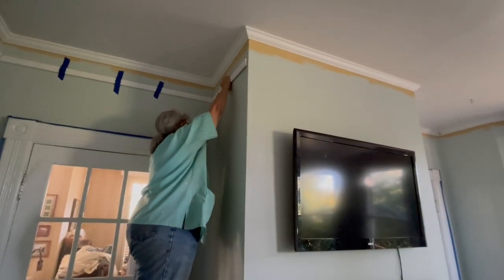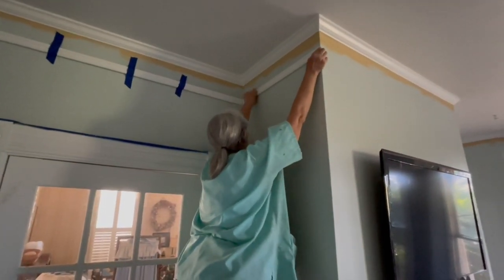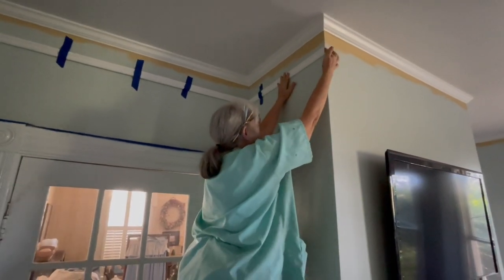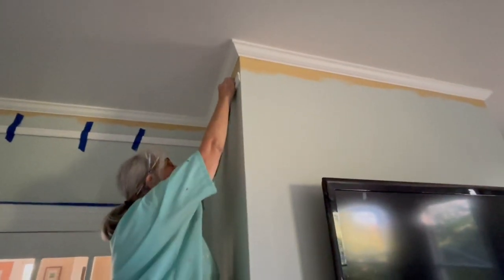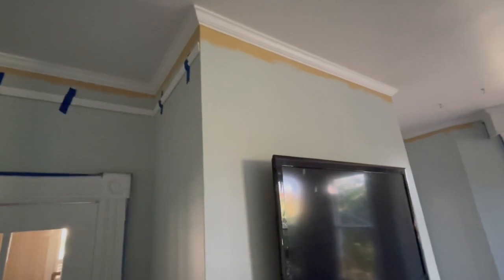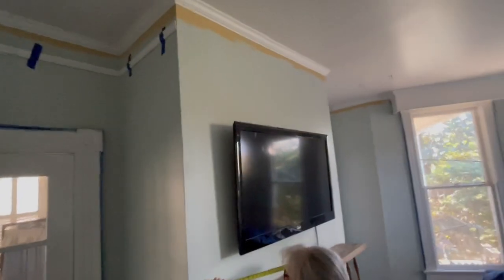All right, let's go show you the inside of that. So here we are, this is the wrapper on the fireplace, and you can see the normal angle in the corner, and then the same angle on the side here, and that will meet up with the next piece and actually wrap around the fireplace. So I hope that makes sense. You can see the difference. So now we're going to have to cut this piece with two outside cuts, one on each side. So let's measure that and keep on cutting.